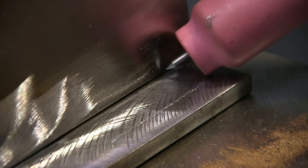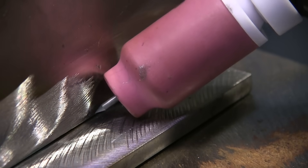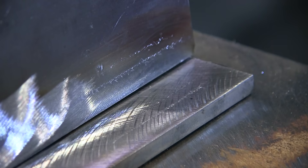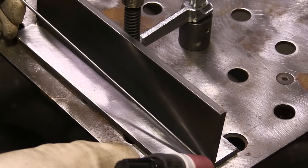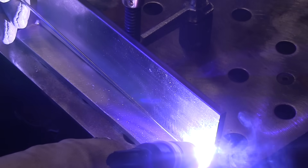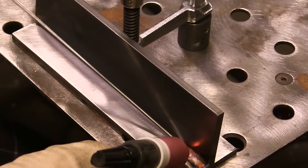We're going to do flat parts first. This is just a regular T-joint fillet weld. The first pass, you just kind of wiggle it barely to keep that tungsten pointed right in the root pass. The second pass, if you were going to do two passes, would be a little different. You can see I've put some scratches in there — we're going to talk about that later. Some parts that's just not permitted on a nice machine surface. I'm using 3/32 (2.4mm) wire, a 3/32 electrode, and this is 175 amps.